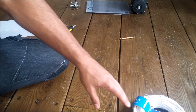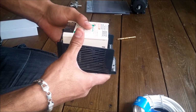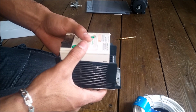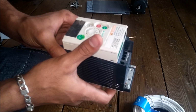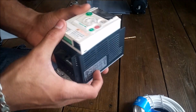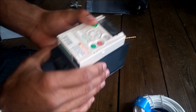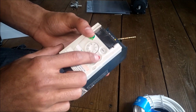And what I'll do is, instead of having the VFD planked straight onto the unit itself of the rotary subwoofer, this can be external, again for safety, so that if the unit does fall over for whatever reason and can't be turned off, this will be a reasonable distance, enough for the user to just turn it off using the stop button.